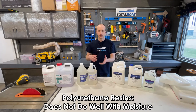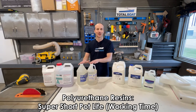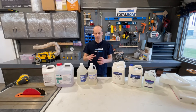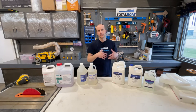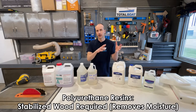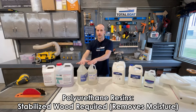One of the disadvantages of urethane is that it's very sensitive to moisture — wood with five to ten percent moisture content will cause bubbles and a terrible finish. The really cool thing about urethane is it's generally really clear and easy to degas, but the disadvantage is its super short working time. I've literally mixed it for maybe five minutes and it was already set — it's not user friendly if you're a newbie. In general, use this once you get comfortable with epoxy resin and wood projects.